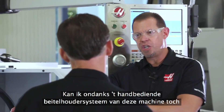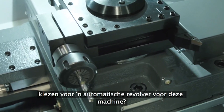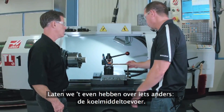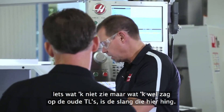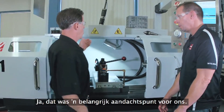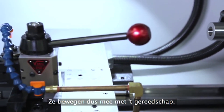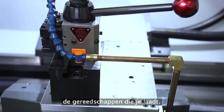Even though this particular machine has the manual tool post, you can still get an automatic turret. The four-station tool changer is still available for shops doing production jobs. On coolant delivery, we're not seeing that hose draped in there like on the old TLs. That was a major focus — we ran the coolant lines internally. They run right into the cross slide so they move with the tool. The plumbing is all reconfigurable depending on how your tooling is set up.